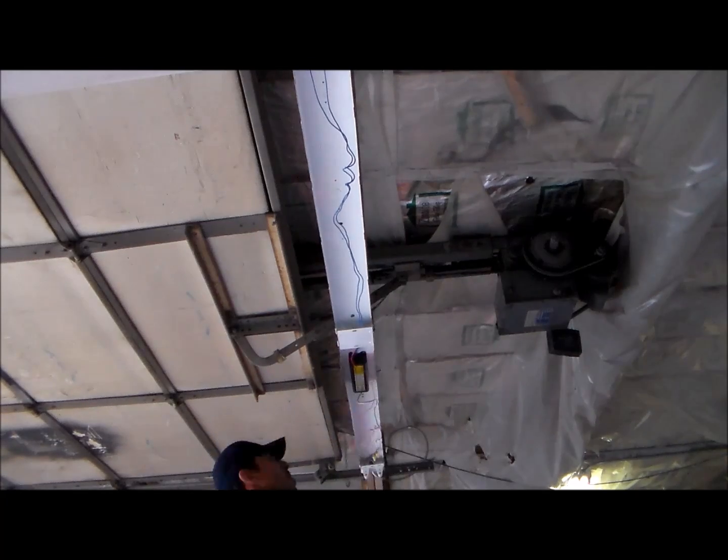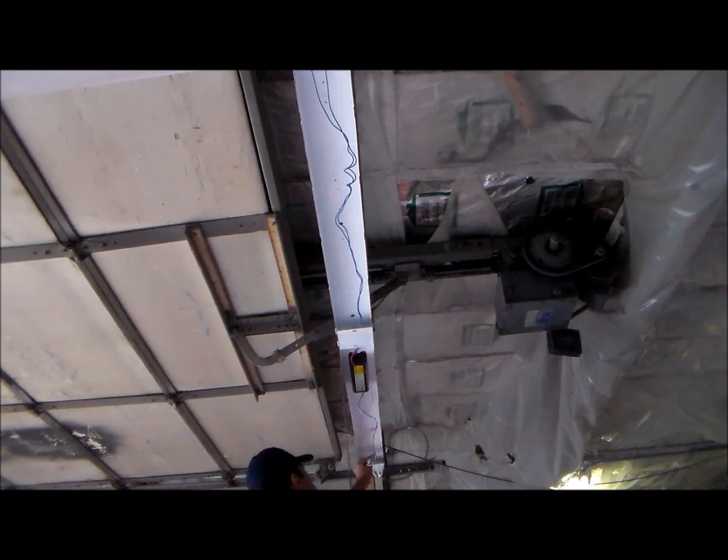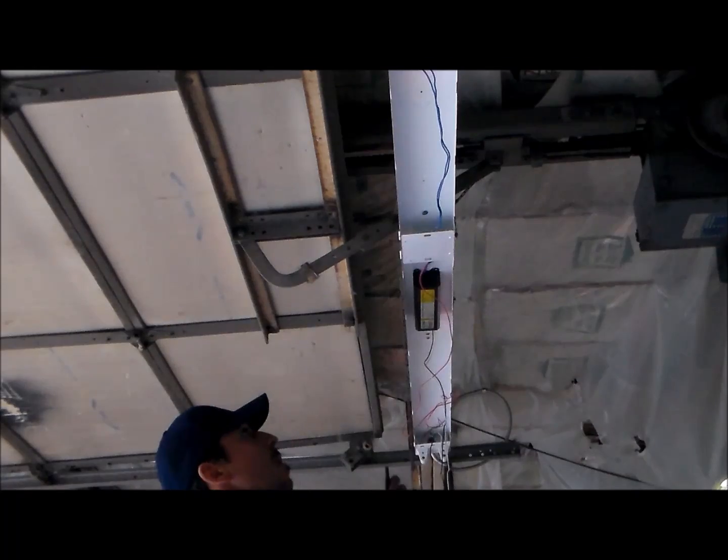Normally there's just a pin that you twist to the side and those covers pull right off. Then we're going to locate the black and white wire inside the fixture. There should be some wire nuts on those — just take those wire nuts off and disconnect those wires.